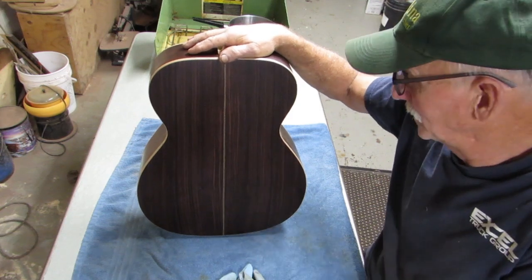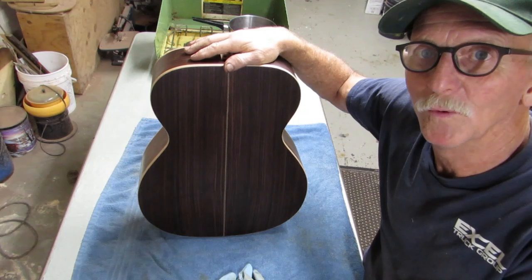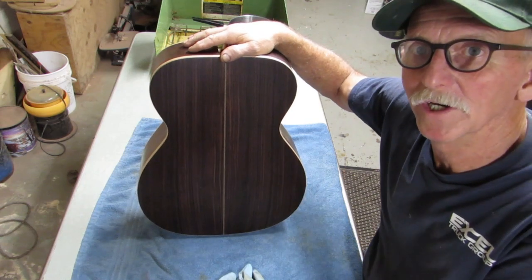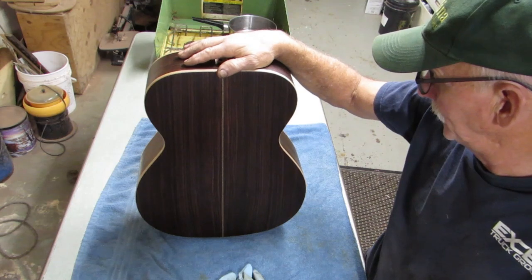The second coat was much easier to sand down than the first. I think the multiple thin applications is the way to go. I'm pleased with the results. There may be a couple spots that I'll need to drop fill, but other than that, I'm good to go.